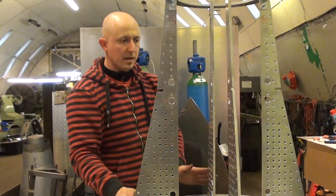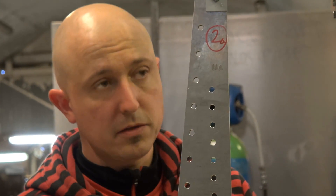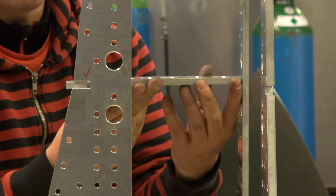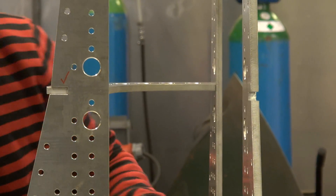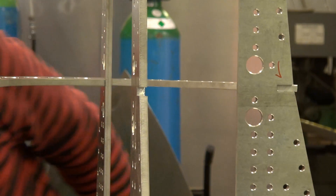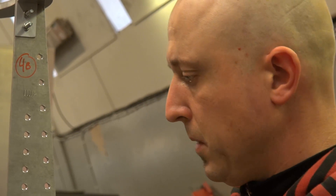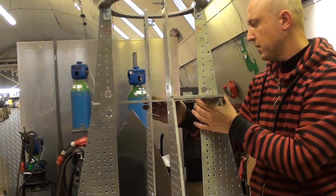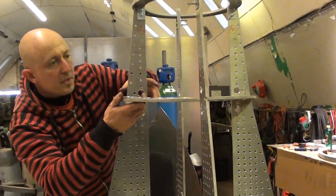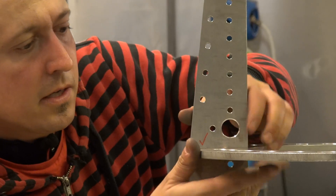Because of these different angles, we're going to have to install another section here so we can add the side panels, and I have those here. They are all four individual pieces and they fit perfectly inside each structure. All these parts when they've been put together are not going to be completely welded — they'll just have a couple of tack points to hold together, because when the main structure is ready for complete assembly there's really no need for taking it apart again, except for the side panels and certain openings.